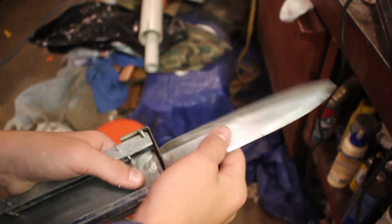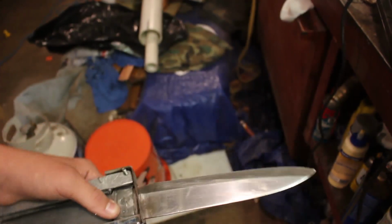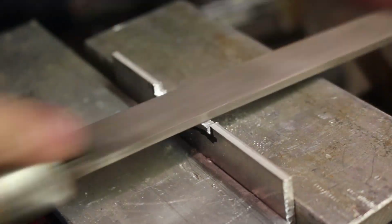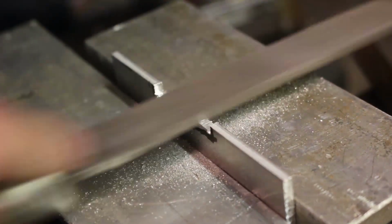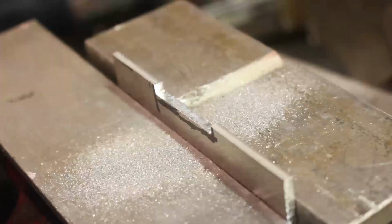As you can see, the blade isn't held in place very well when it comes to moving left and right. So to fix this, I'll add a piece of aluminum with a cut in it just large enough for the blade to pass through. This part needs to be precise, so to assist me, I'll be using super glue to set things in place while I tap or cut the piece. After this, I'll keep going with the layer that holds the hooks down.